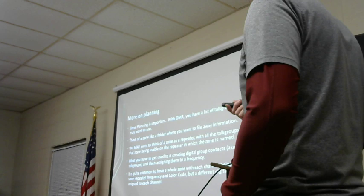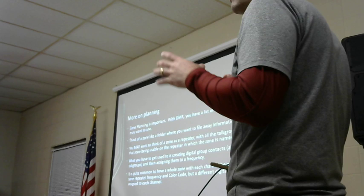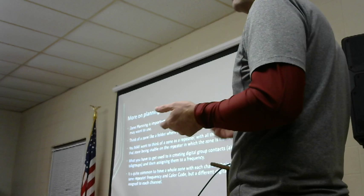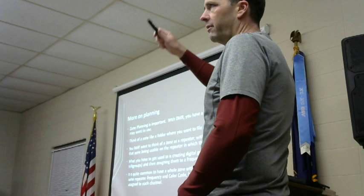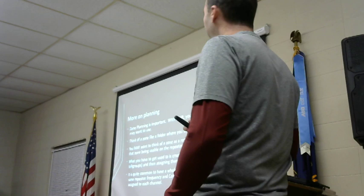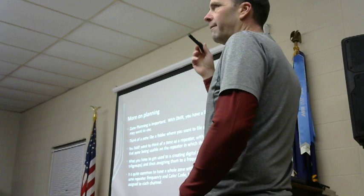The one thing that I had a hard time grasping was when you're programming the radio and you have a zone of 16 channels, all those 16 channels might be the same frequency. The only thing that's going to be different is the digital contact with the talk group. So say 444.400, that is one zone. Every channel will be 444.400 with color code 5, because the color code is basically a PL tone in DMR. Then all you're going to do is assign Southwest Missouri, Branson, Local 2, Local 9, all these different talk groups. That way, every channel in that zone will be the same frequency and color code, but a different talk group.